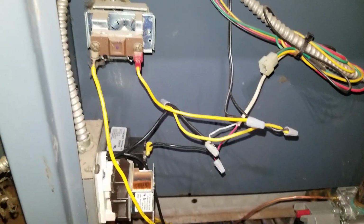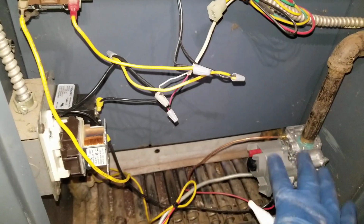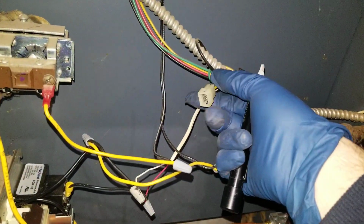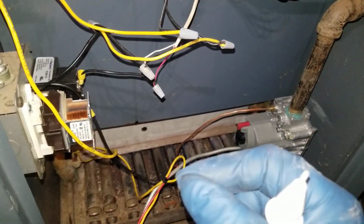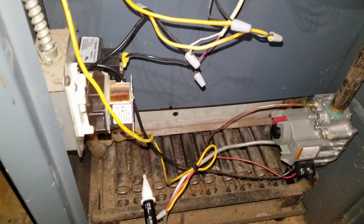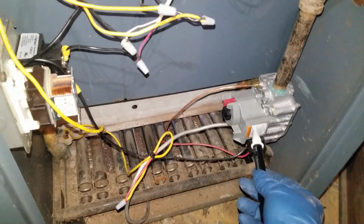And that's the end of the gas valve portion of it. If we had the vent damper connected, that would also go through a vent damper switch, and it would be one other switch. So there is one switch, 2, and 3. All these 3 switches have to be closed in order for the gas valve to be on.